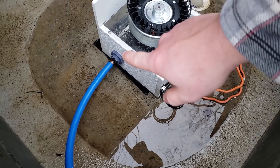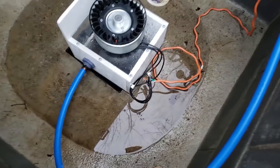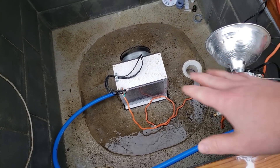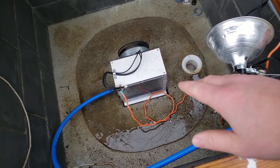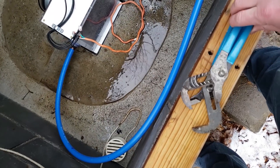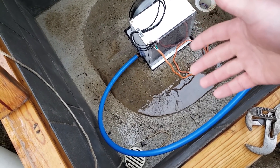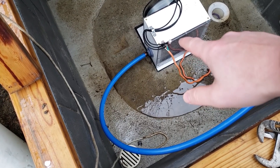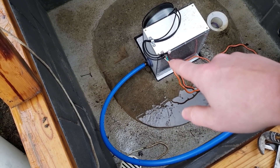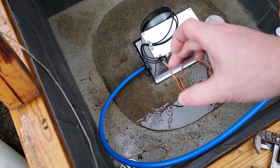I'm going to do that by loosening this bulkhead fitting — it's in a large hole so I can move it around for alignment. After some tweaking, it's actually surprisingly quiet now, even with the lid open. I think the jet was severely misaligned. I tweaked it with this tool and it increased velocity, voltage, and watts significantly. I'm positive now that jet alignment is crucial, and a more accurate jet alignment mechanism than a bulkhead fitting in a loose hole is required.